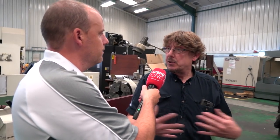Are you getting into deep hole drilling? You wouldn't class it as deep hole drilling in the traditional sense, but 600mm deep - I go 300mm from either end and it joins in the middle, and it's perfection. You can hardly see where it meets. You only get that through rigidity - keeping that precision is all about the holding of the tools and the work holding.